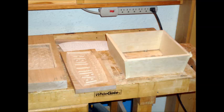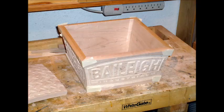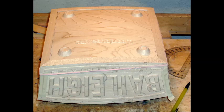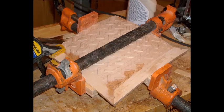Before cutting the sides of the box, I made a test mule using some scrap plywood to make sure I had the correct angles. With the correct miter angles verified, the sides were cut and test fit together. The bottom was carved and cut out using the table saw, trimmed a bit at a time and test fit.